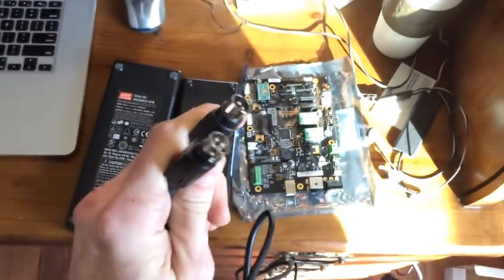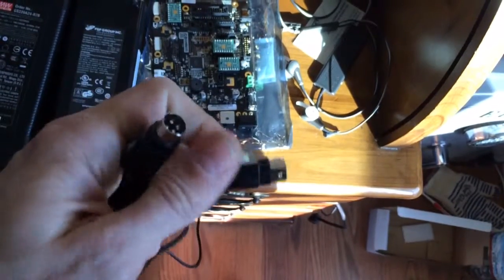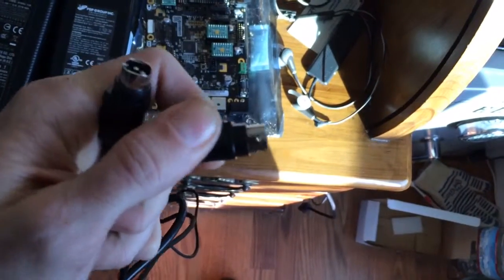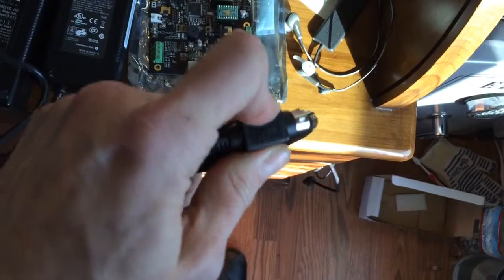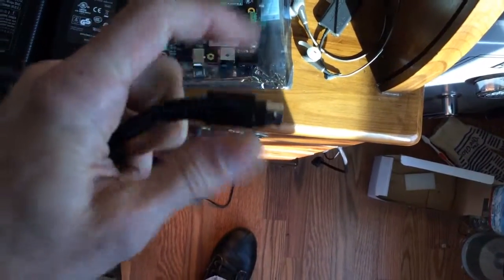There was a slight difference I did notice. Physically everything is the same, which is great. But the new Mean Well power supply actually has an interlocking system — when it plugs into your board, you have to slide this back to release it, which prevents the machine from accidentally getting unplugged if somebody trips on the cord. The stock 6.25 amp power supply that came with the Replicator 2 does not have this mechanism — it does not slide. But the new one does.